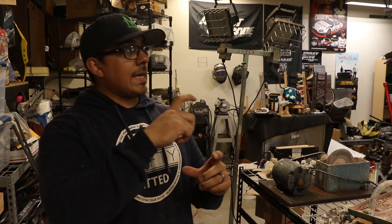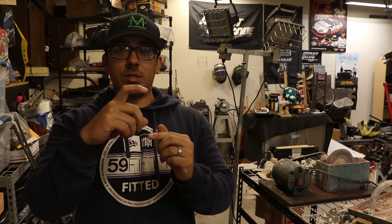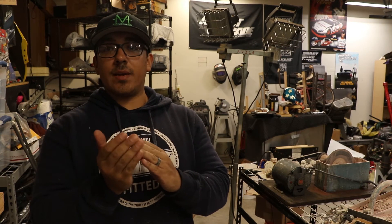Alright guys, so I just finished up the kickstands for the Grom. Like I said earlier, what I did was measure them, mark them, cut them, tack them together, finish weld them, and then grind them all the way down so they were smooth. I didn't record what I just did, but I just primered and painted them. I'll take a couple of photos or maybe a clip tomorrow once they dry so you can see the finished product. All I did was take about an inch and a half off, right below the triangle-style bracket on the kickstand — maybe just a quarter inch below that weld — and then right before the curve from the peg of the kickstand, that's where I measured and cut. If you guys want to do it at home, it's a quick DIY — instead of having to purchase a brand new one, you can use the OEM one. Just measure those spots, take that section out, put it together, weld it back, paint it, and you have a kickstand that will fit all the lowered Groms out there.